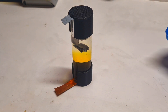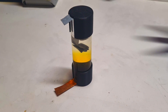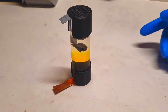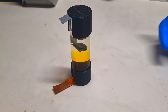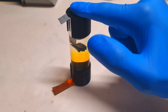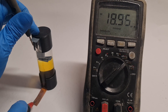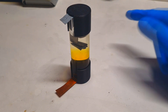On the other side, this zinc bromine battery with this gravity cell design also has some limitations, because the efficiency is not really good. When I charge this kind of cell I need to put in 5.5 volts and I'm able to charge it at 80 mA. If I want to increase the charging current I also need to increase the charging voltage. The power output I get from this cell is only 20 to 25 milliamps. For all these reasons it's good that we improve the battery, which I will do in this video.